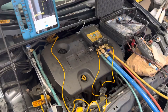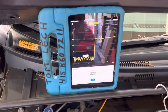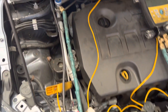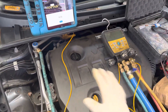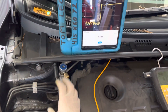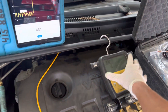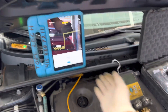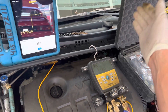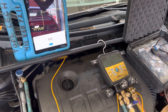I'm going to put this on vacuum a little longer and fill it up. I just wanted to show this to the automotive guys to explain how microns work and why using hoses isn't the best way — it shouldn't be considered at all. But when you don't have a lot of money to buy a separate $200 or $300 dedicated micron gauge with isolation valves, if you're going to have one system, the micron gauge built inside here with the software is a good economical starting point. You get all the data recording: superheat, subcooling, pressures, temperatures — everything you can hand over to a customer or use to diagnose work from another shop, all in one package.